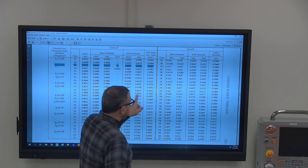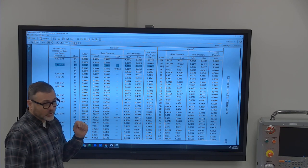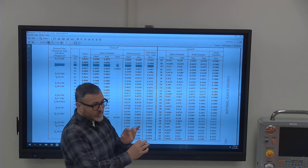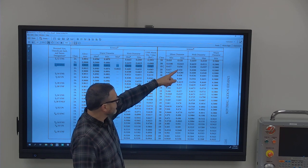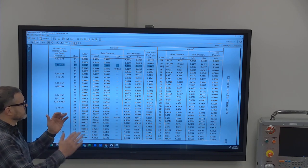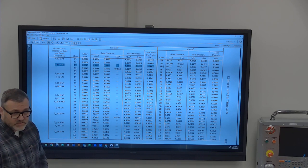All right, so then on the inside of this, you've got 1, 2, and 3B. Your Bs are always going to be your internals. If you're tapping a hole or internal threading, that's a B thread. The minor diameter, so the hole that you drill or bore, is going to be these two, the min and max here. So if you were to tap this, 421 would be a phenomenal drill for it. 417 to 434, 421 fits inside of there. Pitch diameter, 450 to 459.7, is going to be something that's hard to measure.